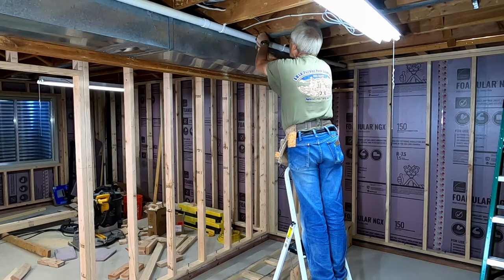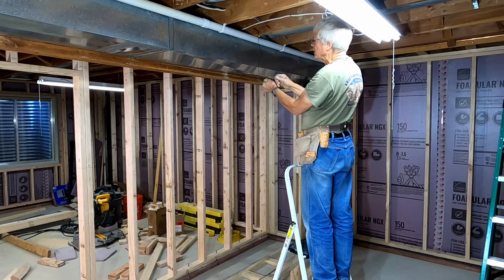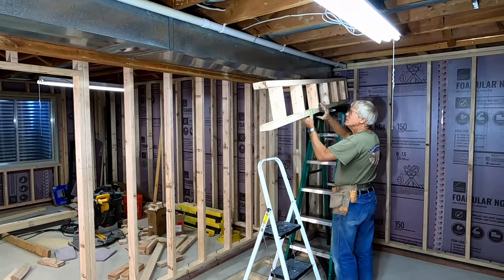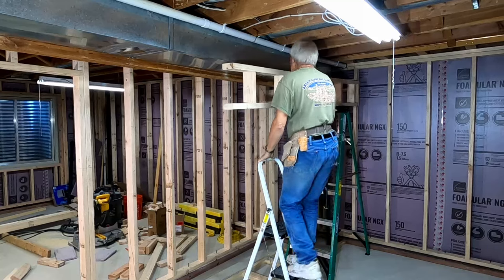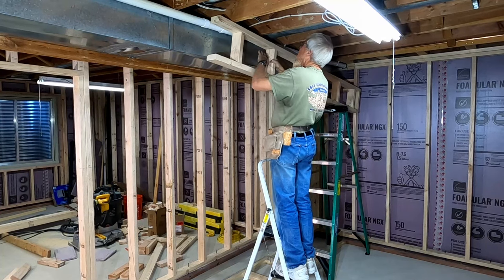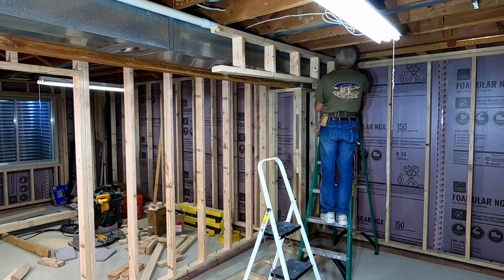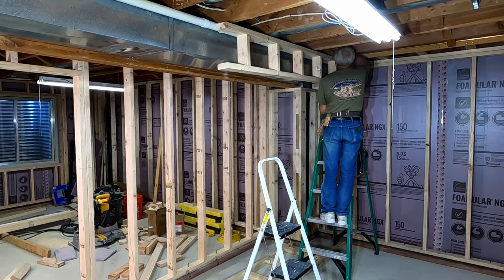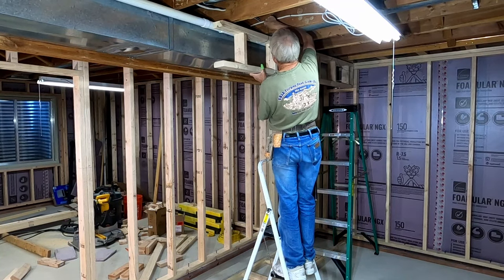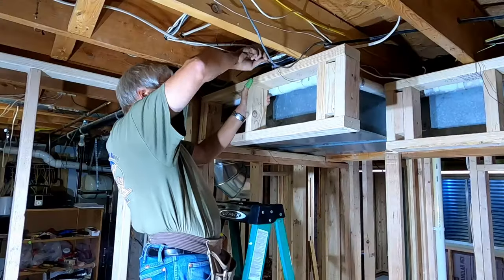I attach a length of tie wire to the nails on the same side of a vertical ladder section. I make a loop at the loose end of the tie wire to reduce the chance of poking myself. I use a 6-foot ladder to support one end of the vertical ladder section, then use a short stepladder to raise and hang the other end of the section by looping the tie wire to the opposite nail. Then it's a simple matter of raising the opposite end to the floor joists and securing with the tie wire. I go back to the first end and tighten as needed. I repeat the process for the remaining vertical ladder sections.